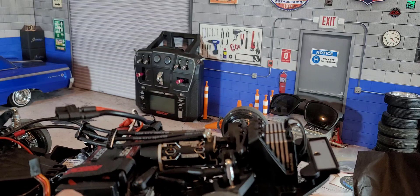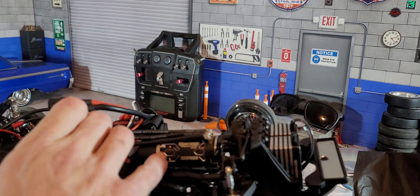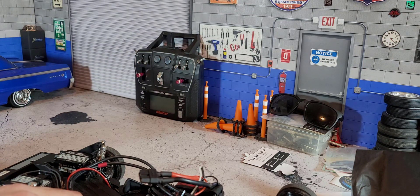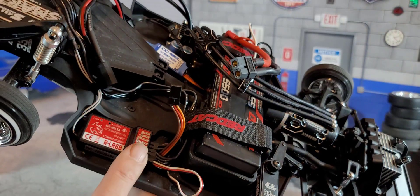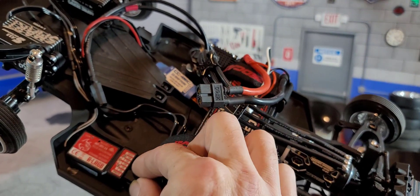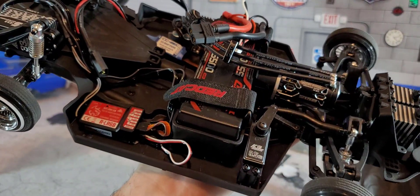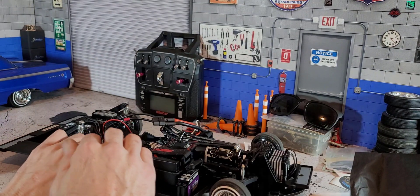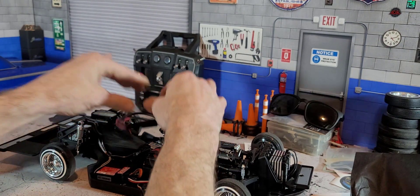The key is to make sure you do not have the red wire going from the ESC into the receiver. Now I'll plug this in. I also had my steering servo unplugged because it was in the way, so I'll put that back in. On the receiver, because we're using all the ports, an easy one to plug into is one of the top ports — it has two top servo ports, I-bus and S-bus. You can just plug it right in there, and now we're good to go. The receiver will be powered, and the ESC is not going to be on yet, but it'll still have the ability to run all the servos.